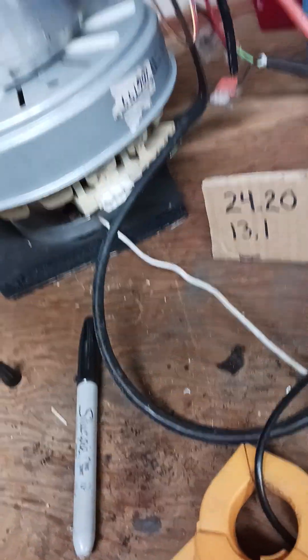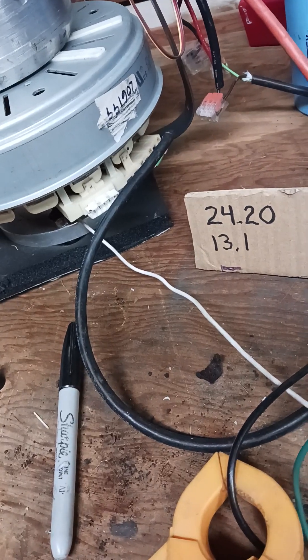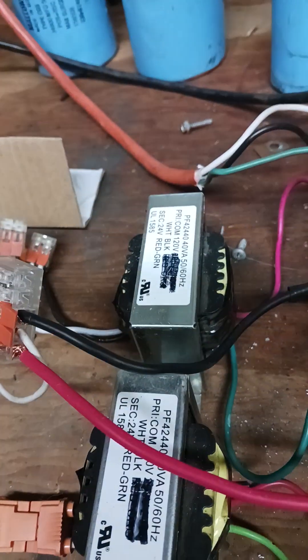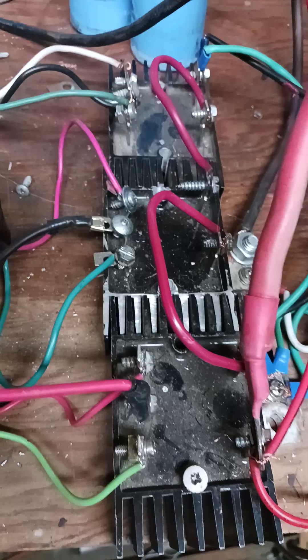There's another wire that comes in — I put a neutral in that Samsung hookup right on the end where they tied everything together on the end of the coils. When they hooked all three phases together, I just tied to that and brought that wire out here to help with stabilizing my system. It's in a splitter right there and one goes to each of those rectifiers.